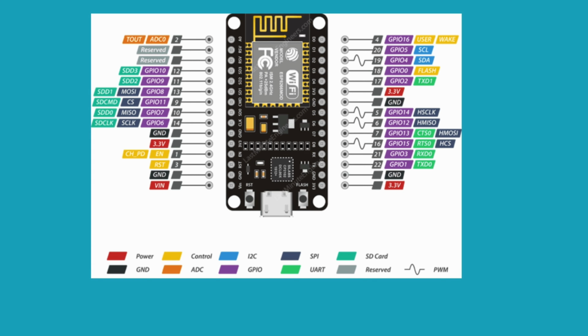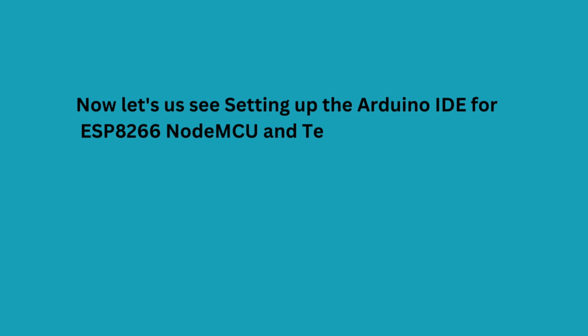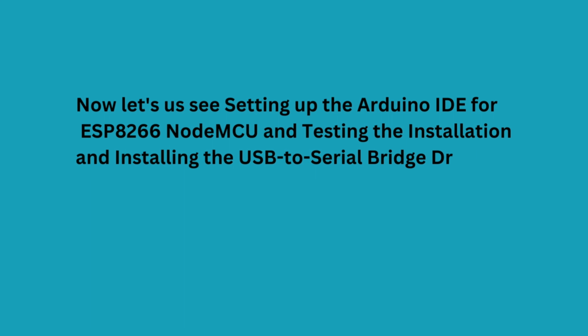Before you can use the Arduino IDE to program the ESP8266, you must first install the ESP8266 board. Now let us see setting up the Arduino IDE for ESP8266 NodeMCU, testing the installation, and installing the USB to serial bridge driver.